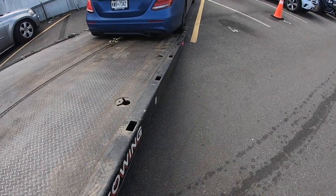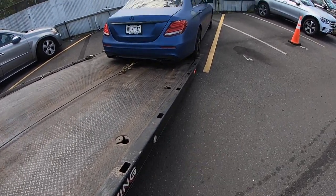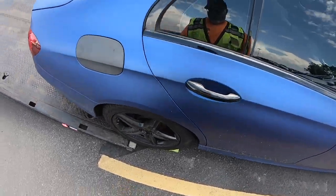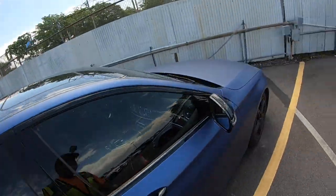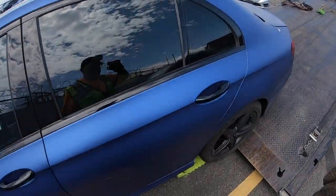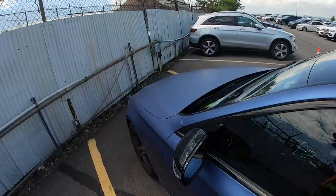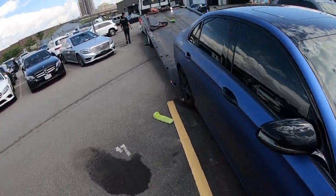All right, so right here now, you tilt the bed up a little bit, because once you get it to a certain point, the tire is gonna be at the edge of the bed and the skate's gonna drop. Take the skate, move it out of the way, and you just do that all around. It pops out on both sides, and then that's it, that's done. And now you can put the bed down and take the bed off from underneath it.